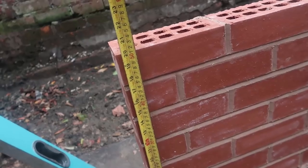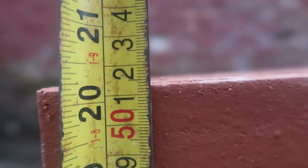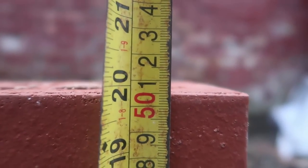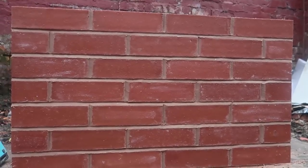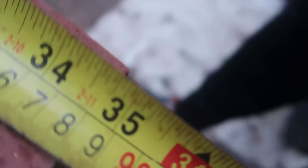Now let's check our gauge. Going to the bottom — we should have 525mm. On this side we are 513mm — it should be 525. This side is even worse: 505mm. That's 20mm out — it doesn't look 20mm out, but that's the proof in the pudding. Brick length should be 890mm. We are 880mm — 880.